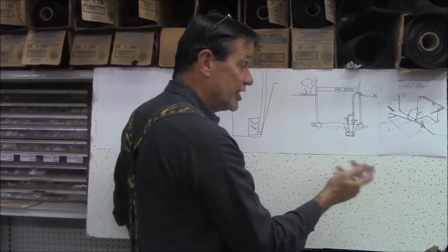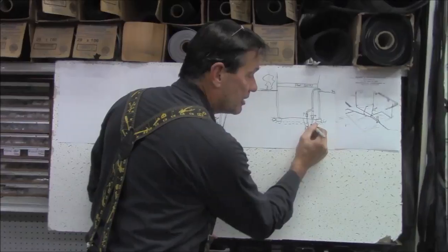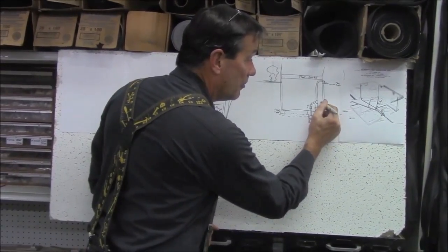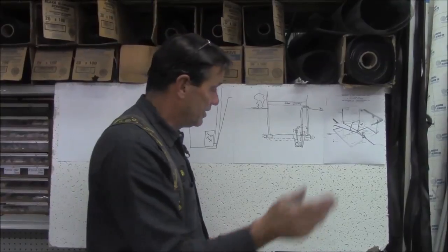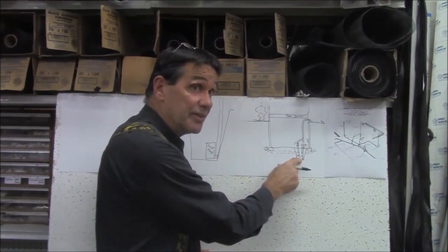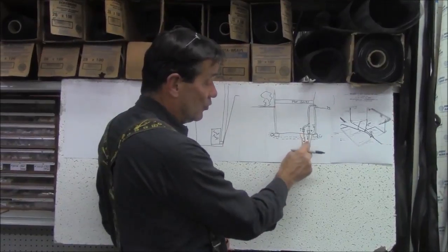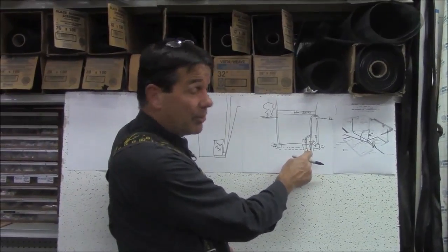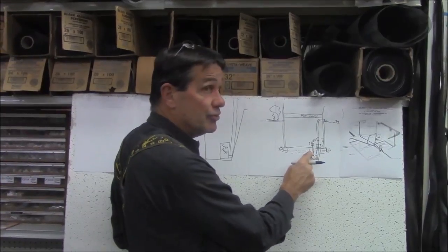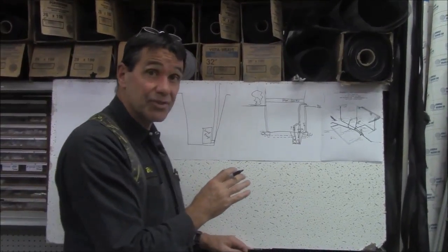This is a good time to get a water alarm — it's like a smoke alarm, comes with a sensor, a little wire, some are wireless. I put an alarm on the pipe at about this height, bring the alarm up and out of the pit, put it on the wall. If the water ever gets high enough for the second pump to kick on, the alarm goes off. We run downstairs and see that the lower pump has finally failed. We pull the dead pump out, take the secondary pump, put it in the low part of the pit — it becomes our primary pump. Now we've got a week or two to go out and buy a new secondary pump and reinstall it. This two-pump system kind of keeps us out of trouble.